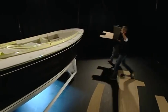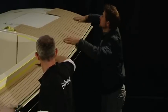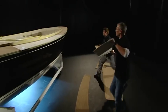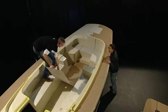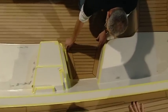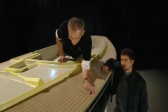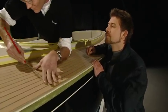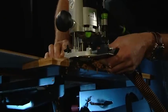Let's lay down the panels on the deck for a checkup. We've used double-sided tape to prevent the panels from sliding, and to see if it all fits. Also, mark all adhesive joints that you will make later. This is where we will make the adhesive joints to ensure that the panels fit perfectly on the deck.